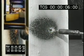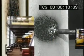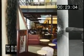Cafco spray film thin film intumescent systems give architects the ability to design using steel that can be decorative and aesthetically pleasing. The spray film coating can be color matched to the surroundings and allows steel to be left exposed to view while providing the required fire-resistive rating. Structural steel no longer needs to be hidden behind ceiling and gypsum board.